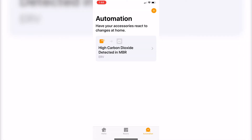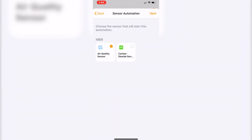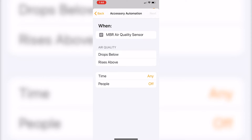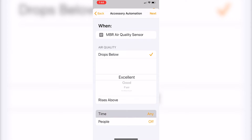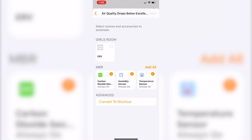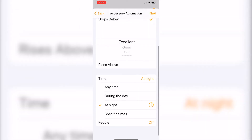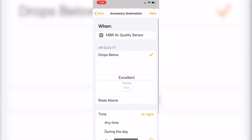You can see I could add more automations here as well. For example, if I wanted an air quality sensor, I could bring on a HEPA filter if air quality drops below excellent at night. It gives you quite a bit of variability — it allows me to select what I want to trigger. Currently I only have the ERV, but if I had more options I could trigger an extra filter. Or if I didn't want to run a PCO-type device all the time, I could only bring it on when indoor air quality was bad. A lot of different options.